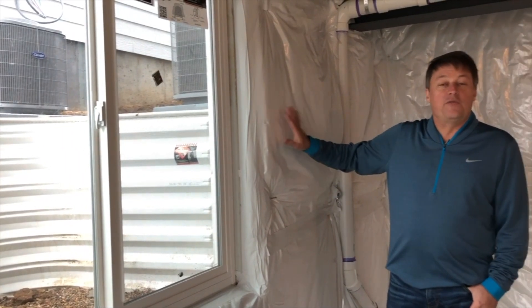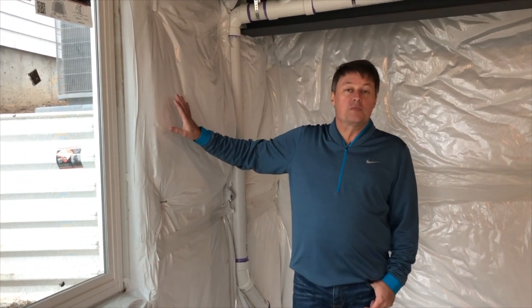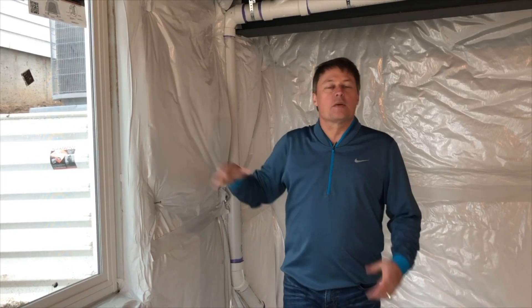Take a look at the video — enjoy it. Any questions, just give us a call. Ken Allison with IDI and we are looking at basement blanket insulation today. When you look at the product itself, we have a facer on there that is reinforced. This particular product has a paper on the back that allows for greater strength — it's not going to tear as easily, so you can run your staples a little farther apart.